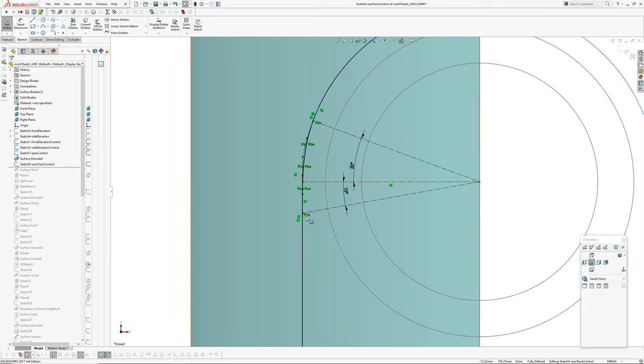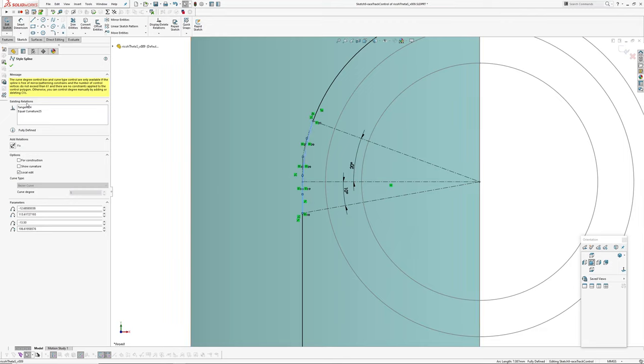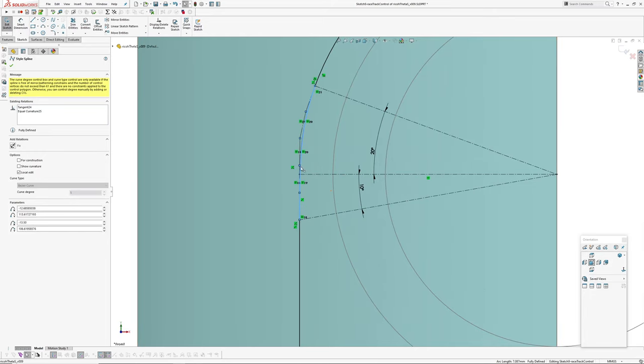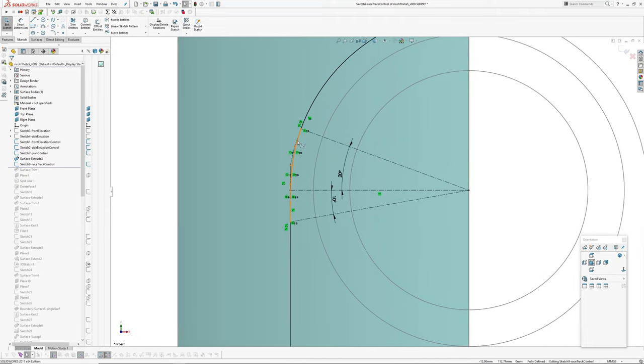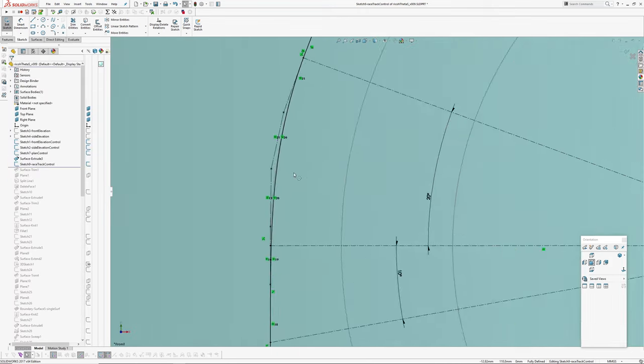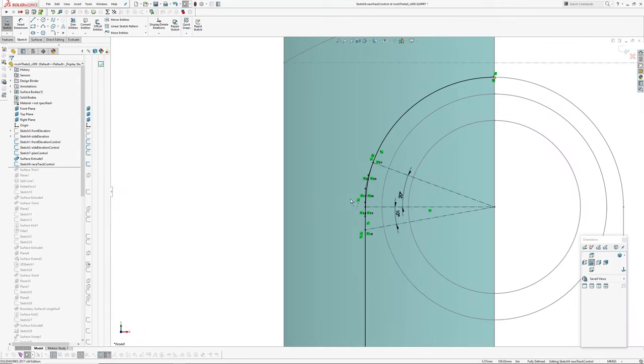What I've done is I've set back this line by 10 degrees off horizontal, and then set back this piece of arc by 20 degrees, and then I've created a style spline — usual story, Bezier curve, degree five. These points here are collinear to this line, because that's a line, so it's a linear connection. And over here to the arc I've used a curvature continuous connection. You can sort of fiddle with those angles. I know it has to deviate from the arc and I thought that was an acceptable amount. This arc up here I wanted to carry on as a true arc rather than putting a spline in, because we've got these circular elements that you want the edge to relate to.